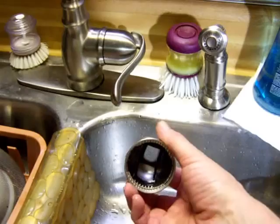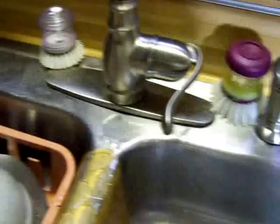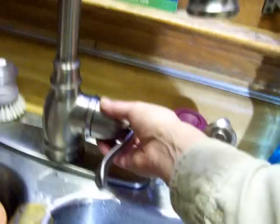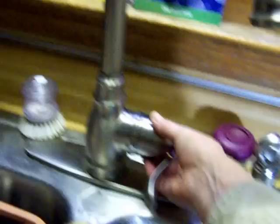So I thought, what's going on? Apparently, just through the action of using the faucet over time — as you move it from hot to cold — it turns the cartridge inside a little bit, which works the cap around to the spot where it can pop off. The cap slips on and then turns to lock in place, and the handle holds it locked. When the cartridge and handle move, the locking rings don't move, so it comes unlocked and the whole thing comes apart.